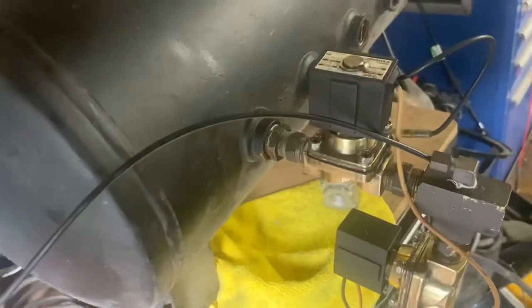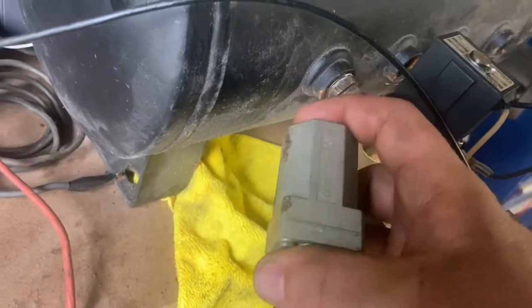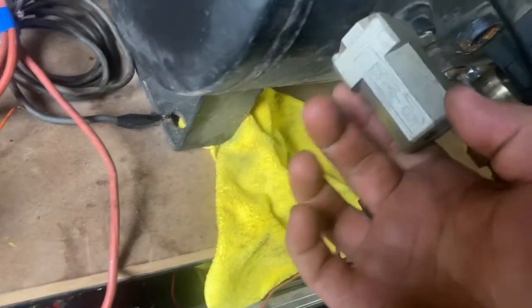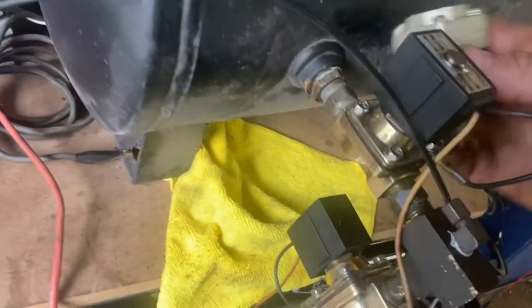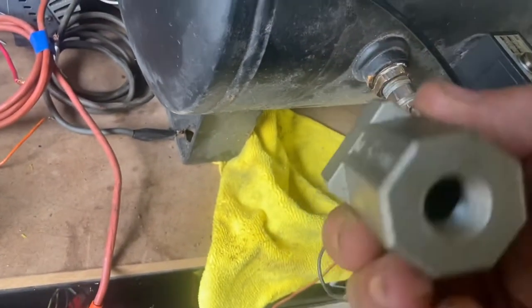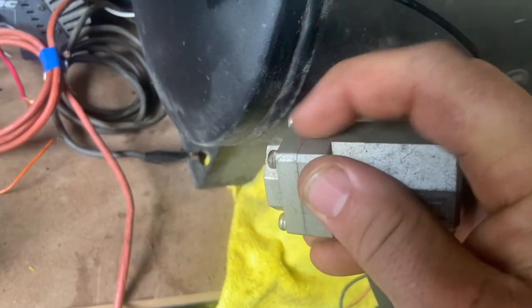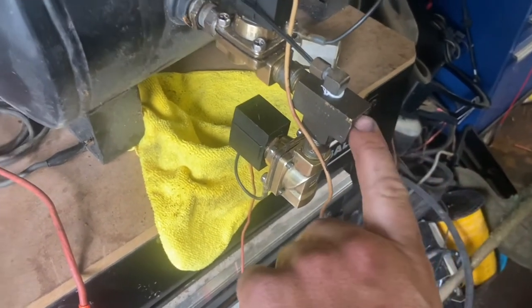As long as your tank is at more pressure or equal to what is outside this valve, it will not bleed back. You can fix that better using a check valve, which would just go in place in that spot. It's got a little 'in' and 'out' marked on it — this one's filthy and needs to be cleaned — but it stops the air from going back through it in that direction, so it only allows air to go one direction.